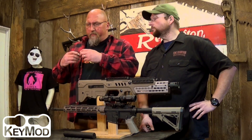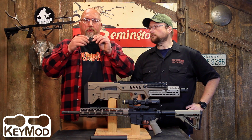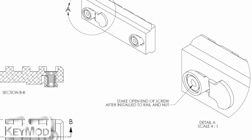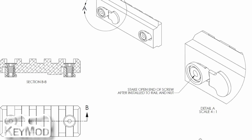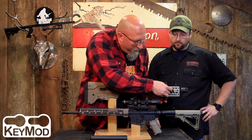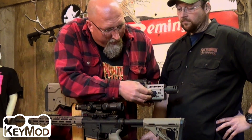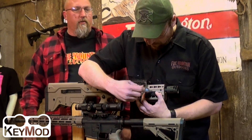Let's talk about how they attach. We have an allen-headed bolt that goes through, and the nut itself has a little eccentric that's machined into it. The nut is round at the bottom, but then it has that eccentric in the middle, and that cams and locks into the small part. You just slip it into the big part — just like putting together a Gorilla Rack — then slide it forward, it clicks in there solid, and then you tighten your allen wrench.